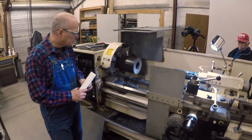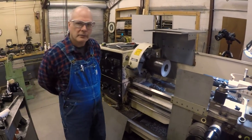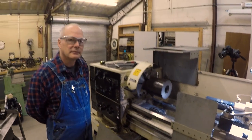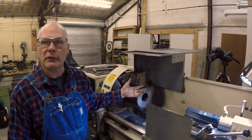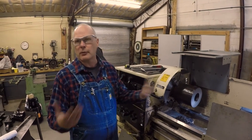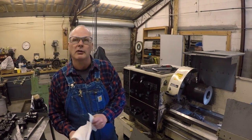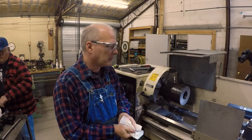When you talk about a basic term in running a machine shop — ROI, return on investment — boy, you've got a piece of material there. A one-inch drill still costs money, and then you've got 20–30 minutes sticking a boring bar in there taking numerous passes. Yeah, and you've got great chip control — you don't have all those big spirals to deal with. You could use a spade drill and get good chip results, but it takes a lot more horsepower, and your spade drill is still only going to be one inch, inch-and-a-half max — then you've got to bore the rest anyway.